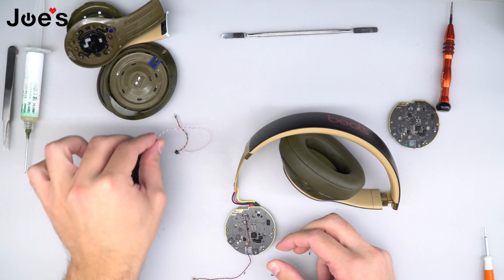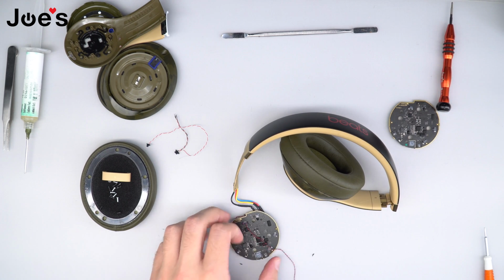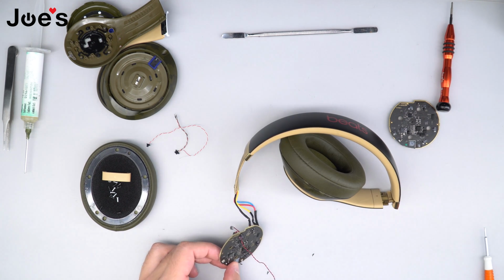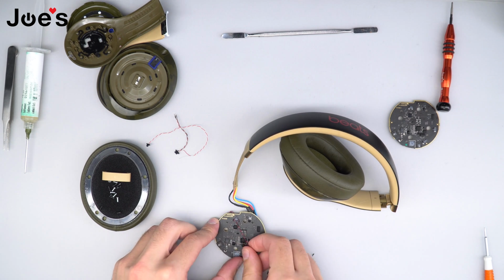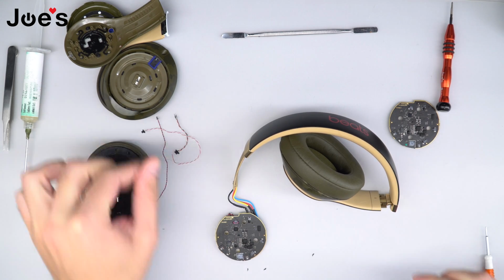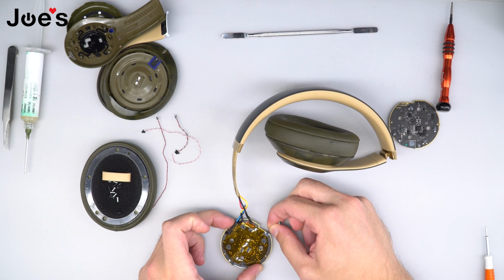The only wire that is really glued on there is the mic bit wire, which for that one, what we're gonna do is we're gonna take the heat gun and we're gonna just warm it up for a few seconds. You don't want to hold it for too long. 1, 2, 3. And go ahead and just pull on it. Once that is done, go ahead, set it aside, and don't forget to remove the mic wire in the back of the Bluetooth board.